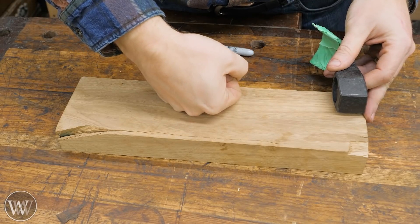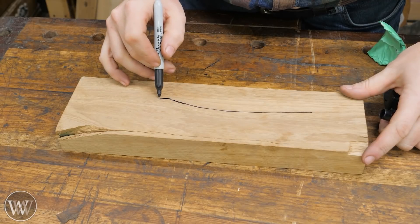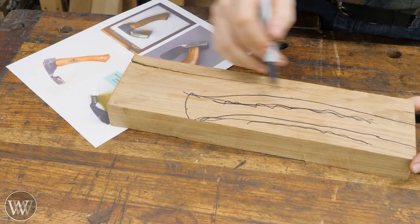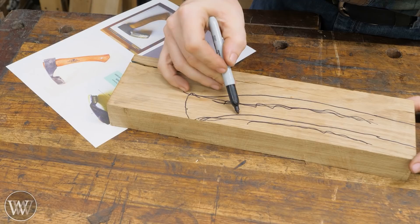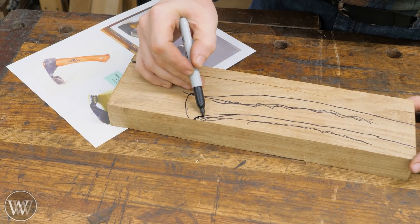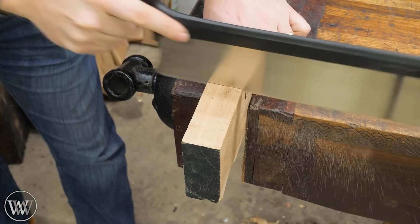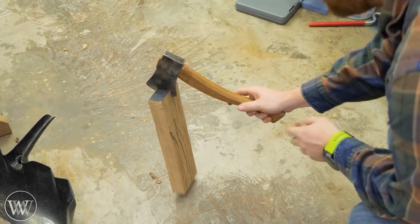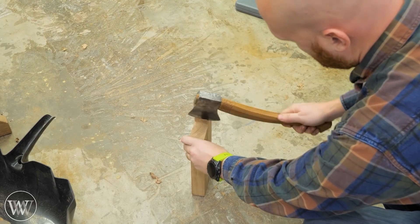This is white oak - what else would I make it with? I know there are going to be a lot of people who are very mad that I do it out of white oak rather than something more traditional such as ash or hickory. But with a small handle like this, it really doesn't make much difference - you can make it out of pretty much any hardwood. I'm just going for a shape that is about what I want. There really is no right or wrong shape for a bowl adze; they tend to have a shorter handle than you expect. Once I lay it out and draw it out, then we can start chopping it.